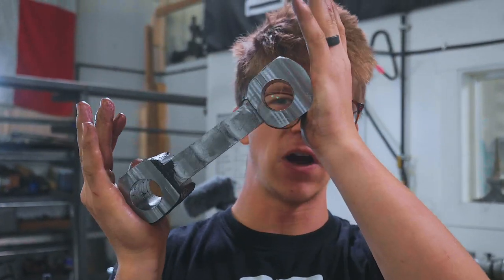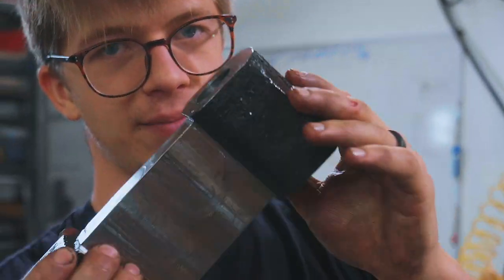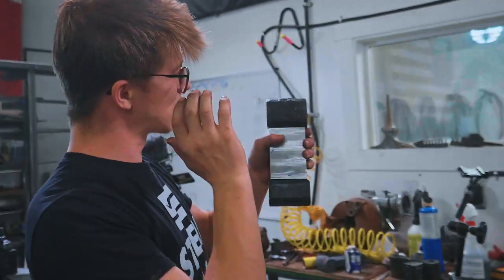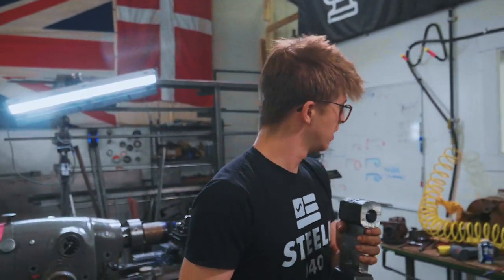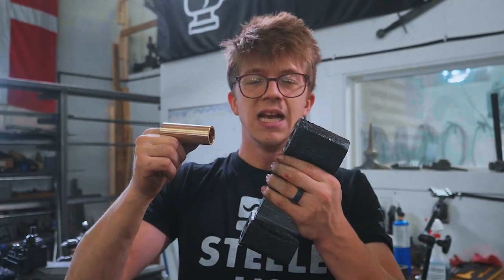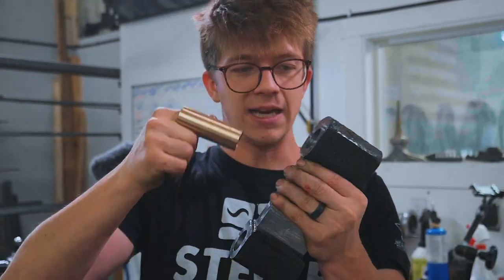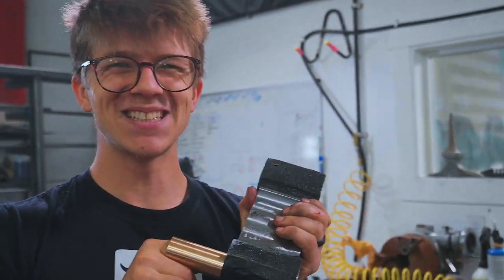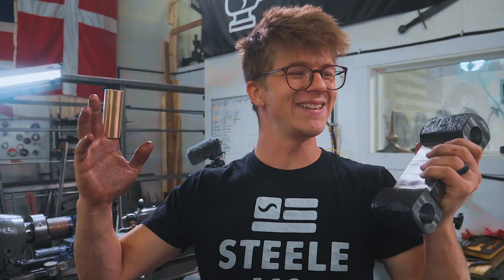Toggle link one is now a functional piece of work. These will get cleaned up because they're very rough right now, and we're going to round it out and make it look neater. The holes are in the right place, it's squared up, it's all parallel. The holes are, however, slightly oversized in one spot. We want an interference fit with the bronze bushing — that's where the bushing is actually too large for the hole and you need to either cool down the bushing, heat up the hole, or both. But it's only one half of one hole that is oversized, so it's not even that much of a big deal.